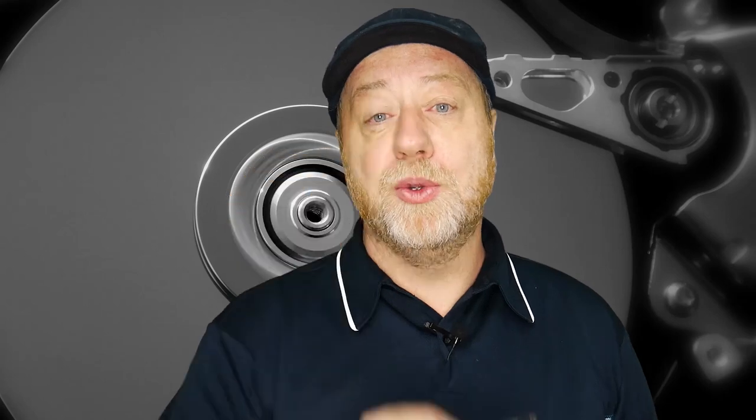Because we're going to be dealing with boards like the Raspberry Pi Zero, we need to understand there are three things that affect performance. The first is the network connection — I'm going to be using the built-in Wi-Fi, which is the slowest option; we could also use USB Ethernet. The second is the CPU on the board — if it's not powerful enough to cope with all that data it will slow things down. And finally, the type of USB connection — USB 2 versus USB 3 — and the type of hard drive connected will also potentially be a bottleneck.